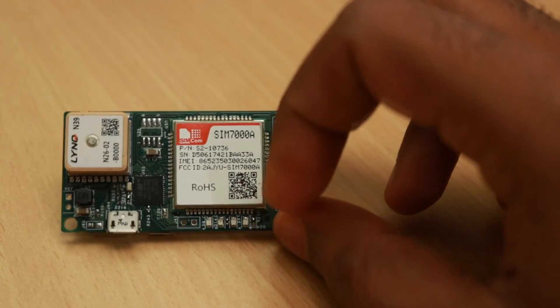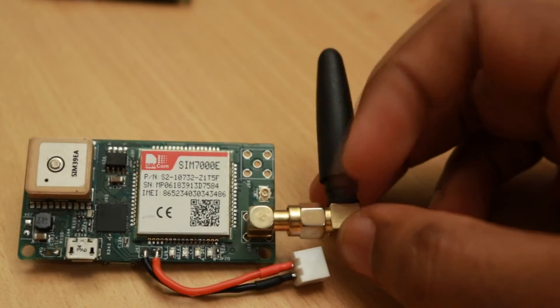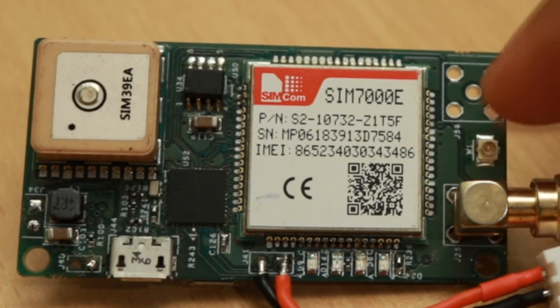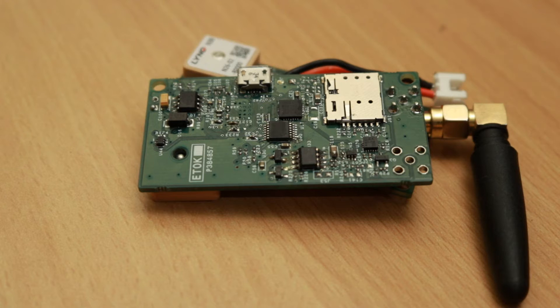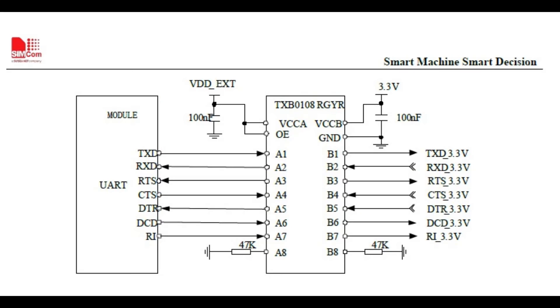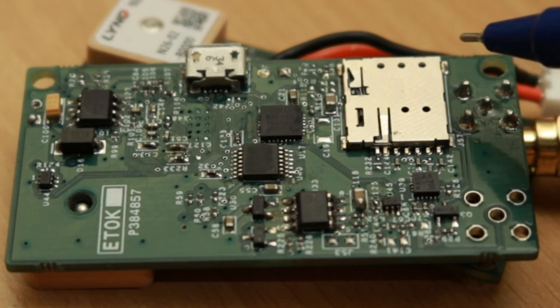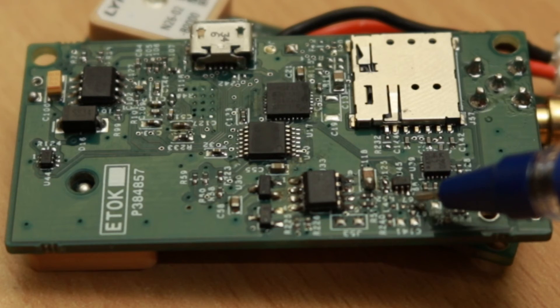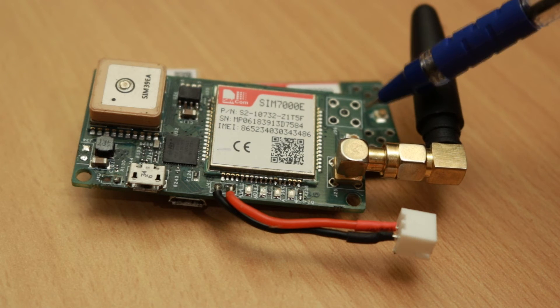A series of LEDs are available for general purpose usage, and some GPIO pins have been routed to LEDs here. The cellular antenna is an SMA antenna but a UFL connector is also provided which can be used for connecting a flex antenna as used in V2 and V2B for size-constrained applications. The SIM7000E uses 1.8V IO levels on its UART and GPIOs, so we added a TXS series 1.8V to 3.3V level translator for IO level conversion between the MCU and the module. A push-push type nano SIM connector is added for easy SIM insertion and removal, and two power MOSFETs are added for turning the GSM module on and off. Since the SIM7000 has a built-in GPS option, the GPS antenna of the module is routed to an SMA connector for future use with an external active antenna.